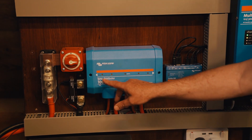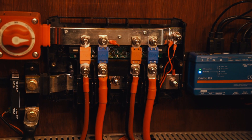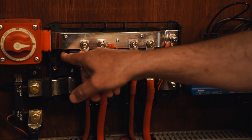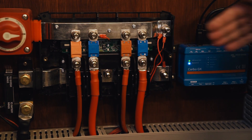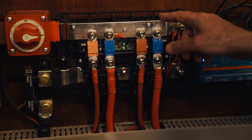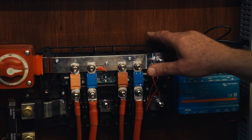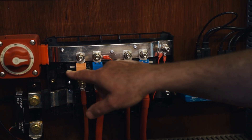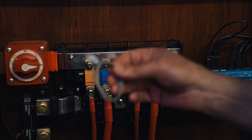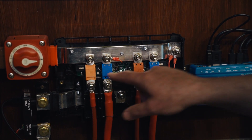It's a very good system, it works great, we just don't have any LEDs here so let's open it up and have a look. We have LEDs but this little circuit board here is not powered up — it actually needs some power, and this is where the power comes in. These gray cables come with the Lynx distributor and they plug in here, so you can use them to daisy chain several Lynx distributors if you have lots of devices. We need to apply essentially 5 volts USB-type power into here, so we're going to use this cable and make up something to go from 12 volts from these two terminals to get these LEDs to work.